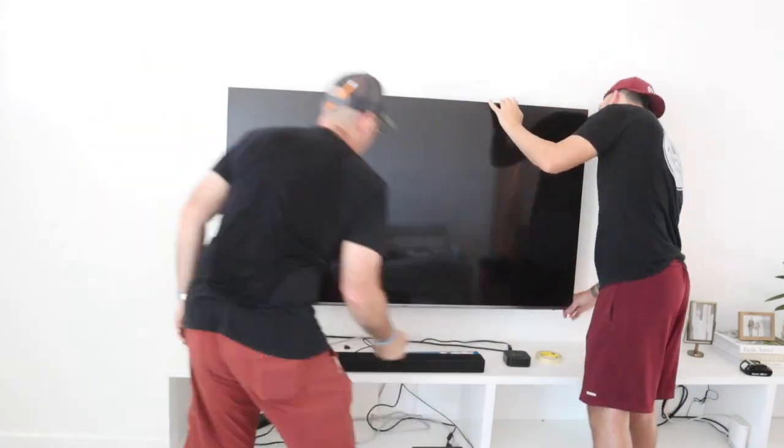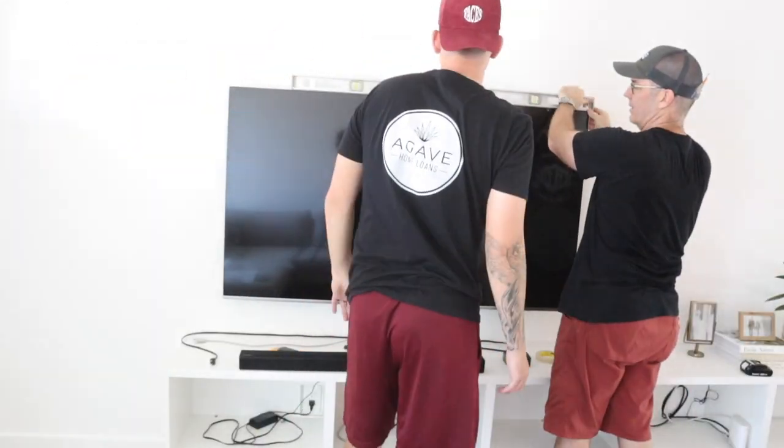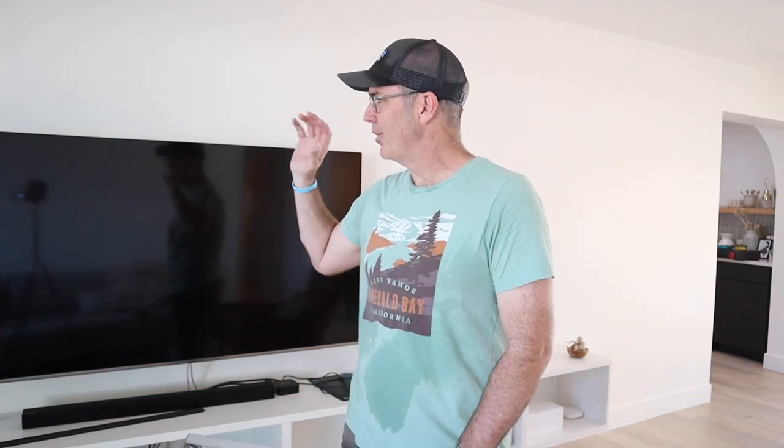I make sure my son is dressed just like me, and we throw up that TV and this job is done. Hopefully this answers some of the questions I invariably get on drywall on block. Honestly, when you've got drywall, wood, and concrete or block, you've got a very sturdy surface, so it doesn't matter really where you hit. Check out some of these videos. I would love for you to consider subscribing. If you've got a better way to do this, throw that in the comments. Take care, we'll see you next time.